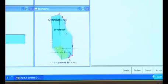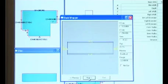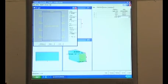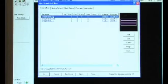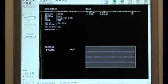The user can then choose to make the part in one or in separate pieces, dependent on personal preference. Once drawn, panels can be saved and sent directly to the machine. The saved files can be used time and time again, simply brought back in and edited if required. The nesting capabilities of the software are also vital, and the orientation of the part can be manipulated to allow efficient sheet utilization, cutting down massively on waste material.